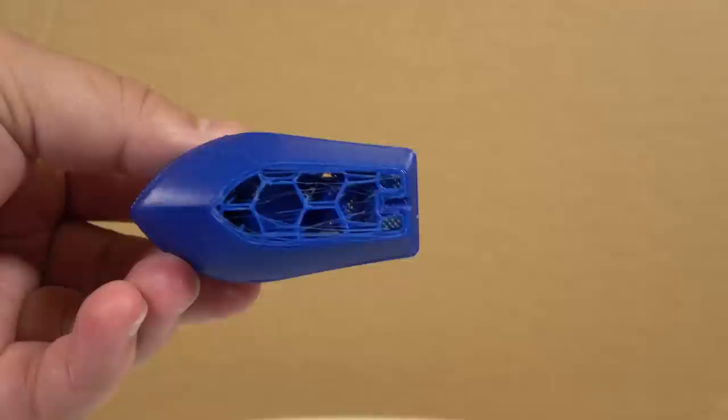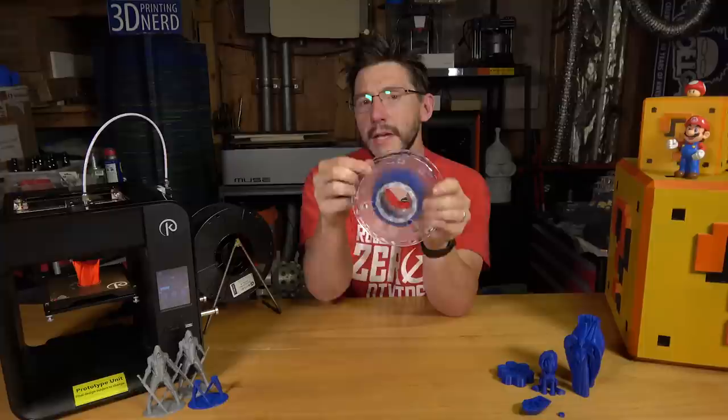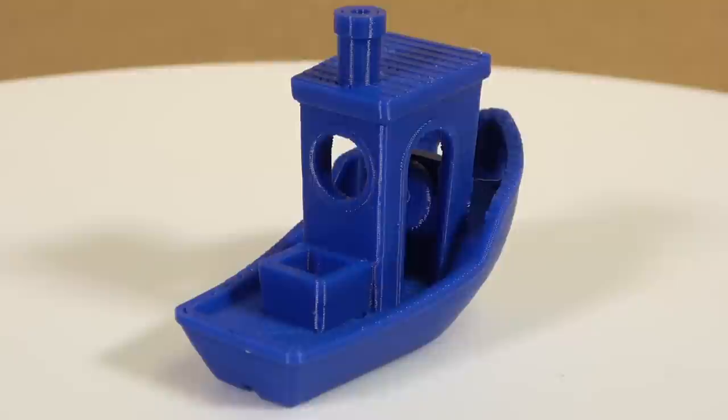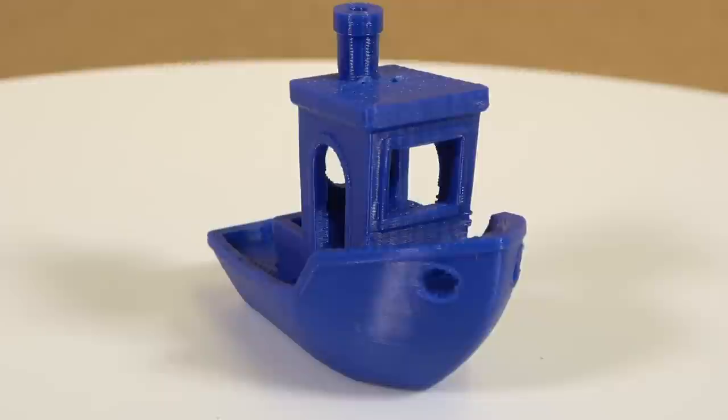It is missing the bottom — but here's why: when John brought the machine back to me, he had put a piece of tape over the filament to keep it sturdy on the spool holder. I forgot about that, didn't see it, and it yanked the spool up into the extruder motor and started clicking. I luckily got to it, removed the tape, and let it complete. So the bottom part of this benchy is somewhere in the kitchen, while the top part is glorious.